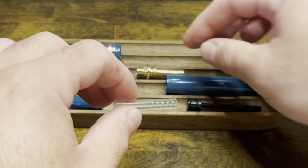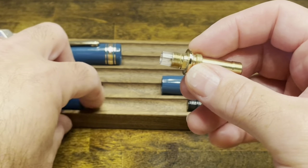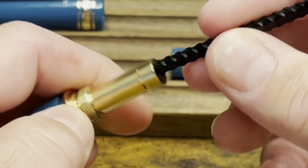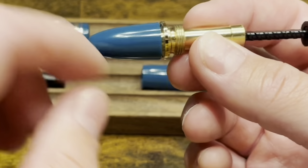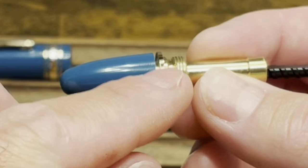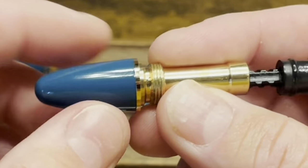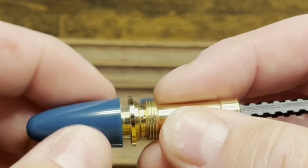To reassemble, we'll start with our key and our brass connector. The key just slides right in, and then we'll give the piston knob a few twists, grab our piston rod, and if you look closely, there is a slotted hole at the end of this connector piece. We'll line that up and give it a twist to screw down the unit. What we're looking for is the piston knob to butt up against the first flange on this brass piece, and when it reaches that flange, we want the piston rod to be as retracted as possible. That's pretty good, although we do have a decent amount of rod still exposed, so I'm going to unscrew it and try to reassemble again.